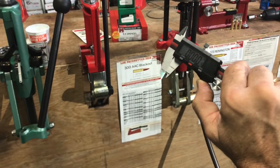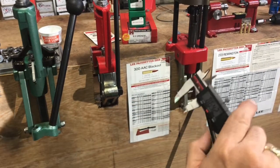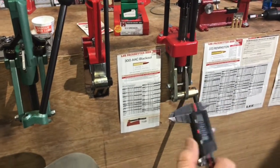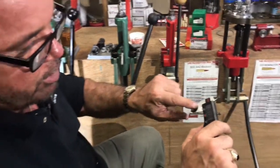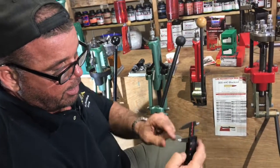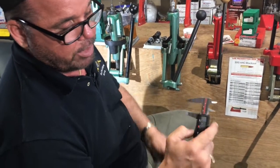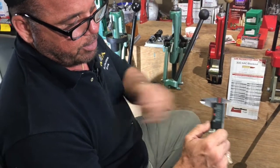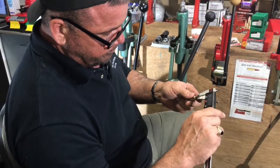Sometimes these will get sprung, okay, guys? And sometimes, machine shop basics. When it warms up, these are going to expand, so these might give you half a ten-thousandth off, and these will collect oil and dirt. You can take some alcohol and put it on a piece of paper and just stick it between there and pull it out, and that cleans it.